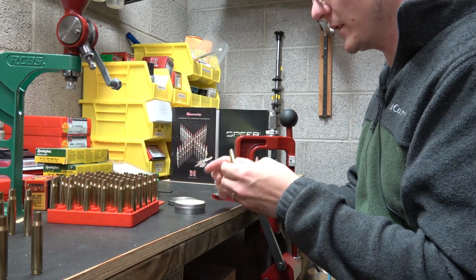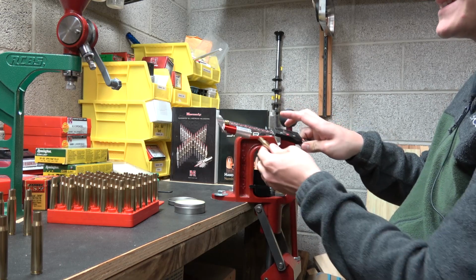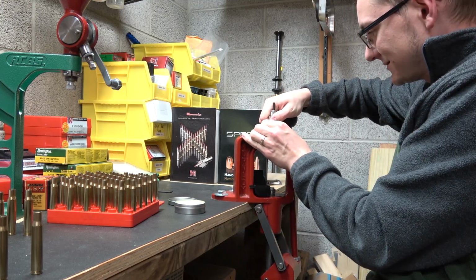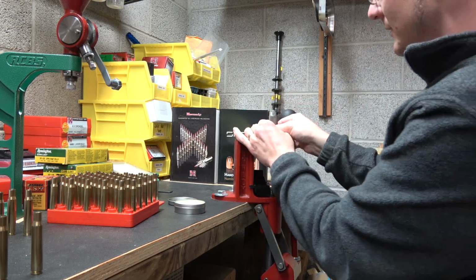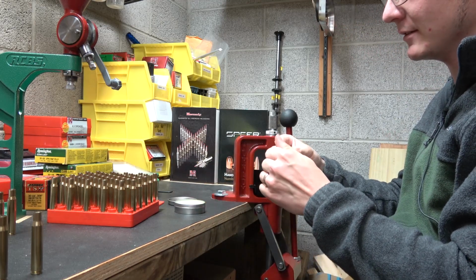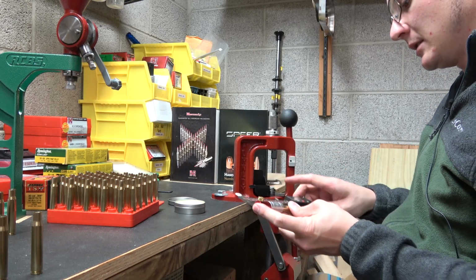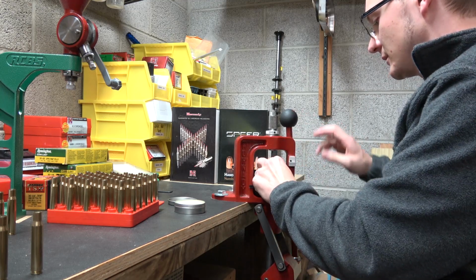Let me do a fresh case here. All right, that one is saying I bumped at 7/1000ths, which is too much. I'll set that case aside. I'll back that out a little bit and we'll see if we can get maybe back around that 5/1000th mark, which is probably closer to what I want. Okay, this case has the same 0.